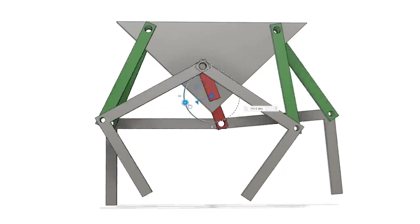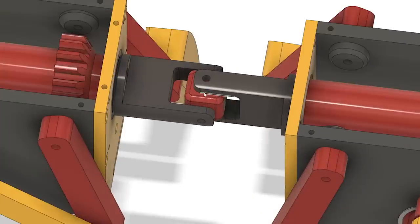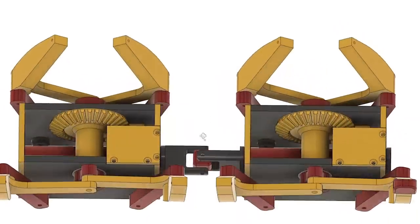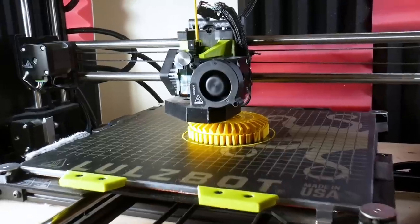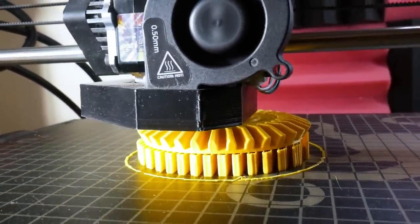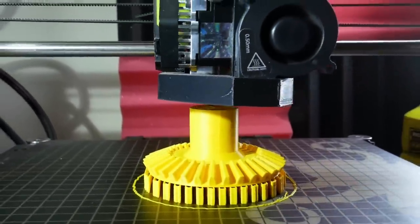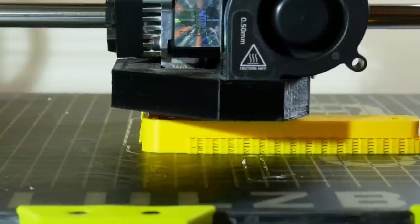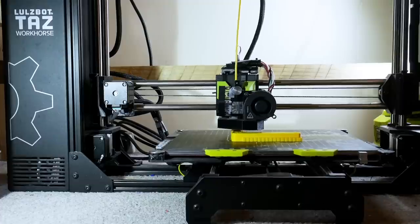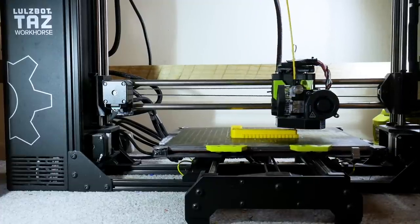I want to make this machine 4 or 5 segments long and drive the whole thing from a single motor, so I've designed universal joints to link all of the sections and a gearing arrangement to drive everything from one overhead driveshaft. There are quite a few parts that have to mesh properly — mainly these bevel gears which translate the motion from the overhead driveshaft down to the legs, and those have their own built-in driveshaft with bearings at each end. If there are going to be 5 sections with 4 legs, that's 20 legs total, and those have some weird overhangs so that they mesh properly and can fit onto the pivot points.